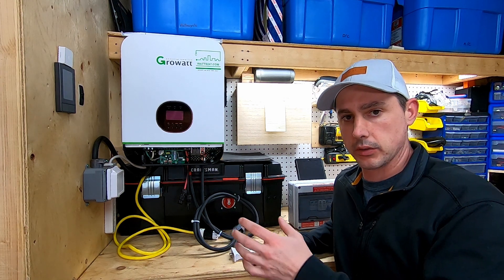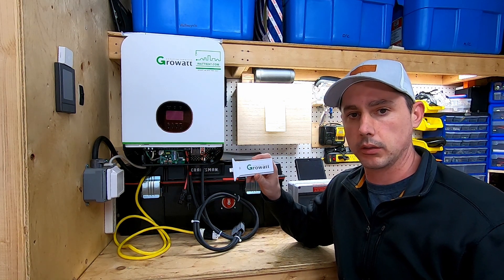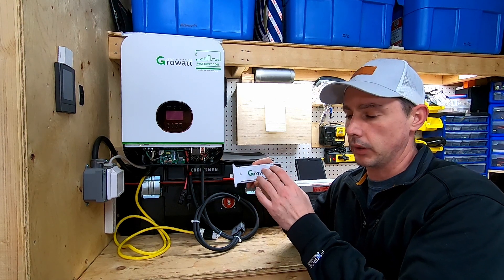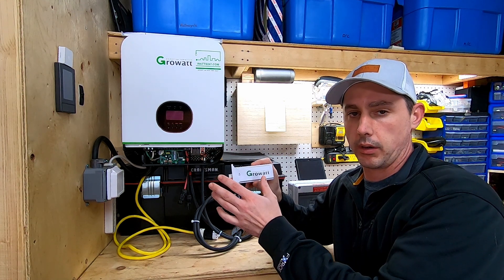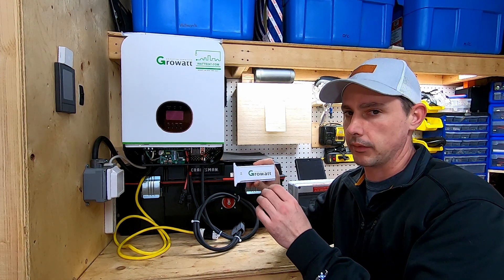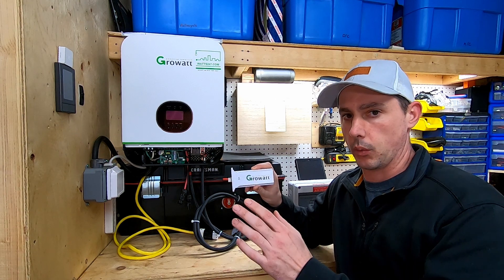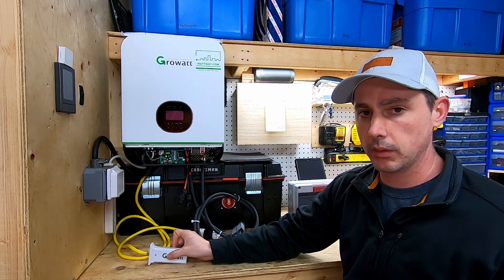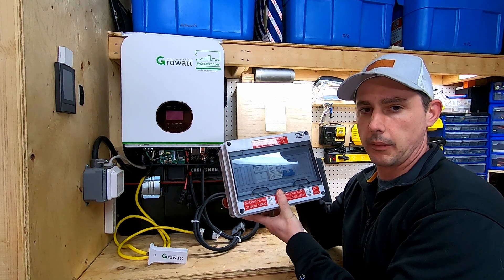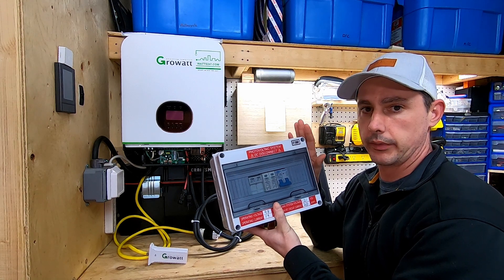I haven't touched on all the features yet but it is amazing. Next video I'll show you how to hook up the WiFi dongle - there are specific configuration parameters you need to set for it to connect. You can also remotely change settings through the WiFi. One key tip: don't ever do a factory wipe through the WiFi because you'll wipe the memory on the stick and it won't work again - this is my second stick. I'm also going to do videos on my full solar hookup and a combiner box build for the solar inputs.